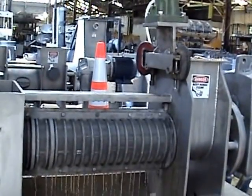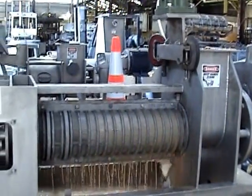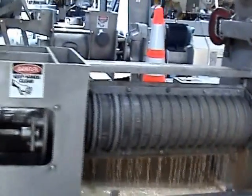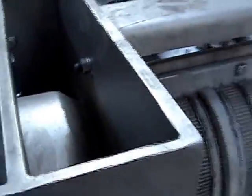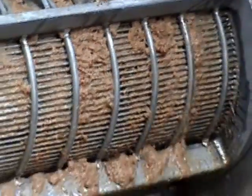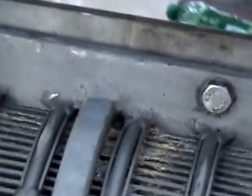This is an oversized regulator. Before I forget — this is the coarse side of the screen — notice at this end of the press we're getting more solids coming through. And on this side, where we have the screen coiled to 15 thousandths of an inch slot, I'm finally getting some cake to start coming out of this press.